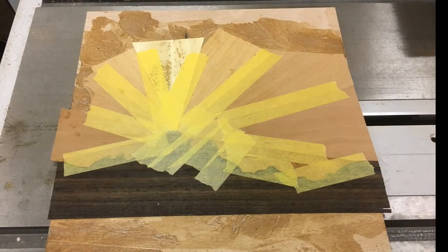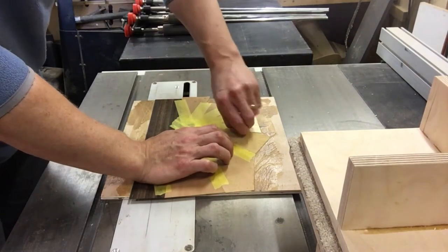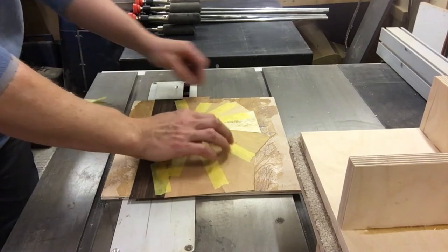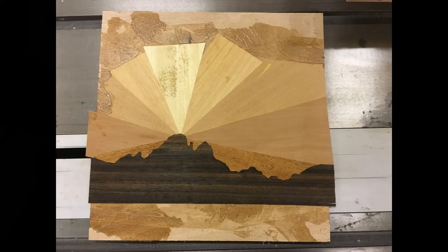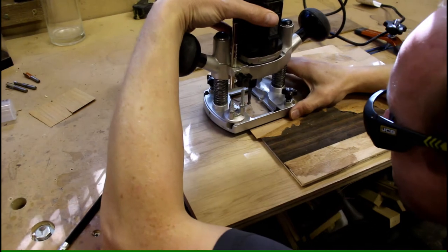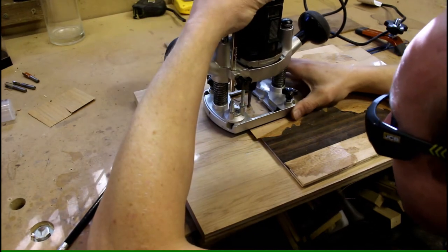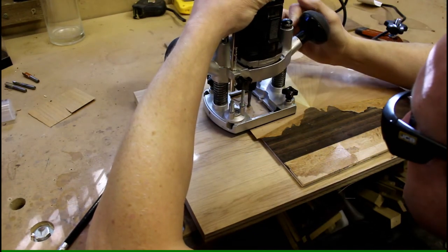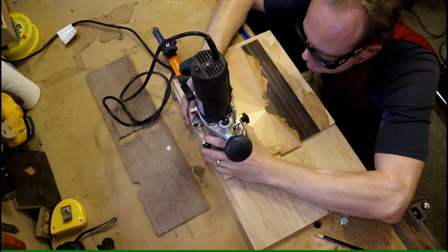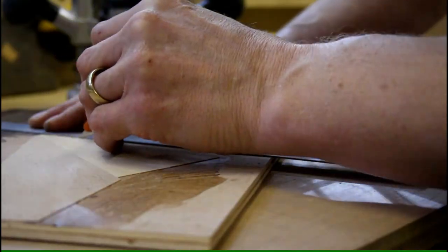After a couple of hours, once the glue has dried, the lid is removed from the press. The painters tape is then removed and the marquetry is inspected. In this case I noticed a lot of glue bleed through on the grey veneer. Using my router, knives and chisels I removed the faulty veneer. Breaking the veneer along the glue line between the glue and the plywood was very easy to do and the veneer came away relatively cleanly.